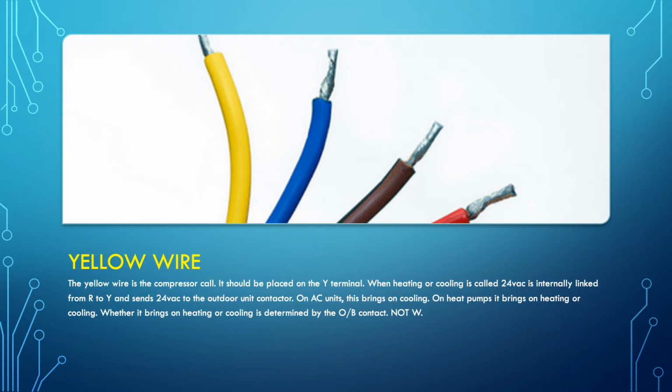Yellow is your compressor call. Now, whether it's heating or cooling, or a heat pump, or an air conditioner, you put the yellow wire on the Y terminal. We're not using other colors. If yellow is available, it goes on the Y terminal. On heat pumps, it brings on heating, and we're going to talk about that in a little bit. But you do not need to put a wire on W for a heating call with heat pumps. You only need the wire on Y to bring on the compressor and the outdoor unit.